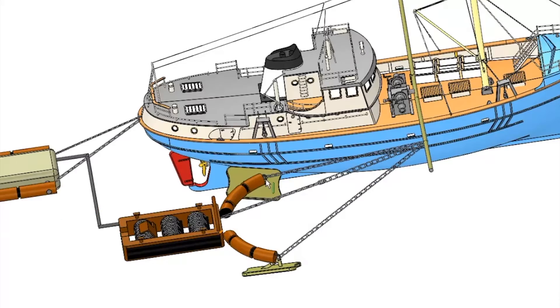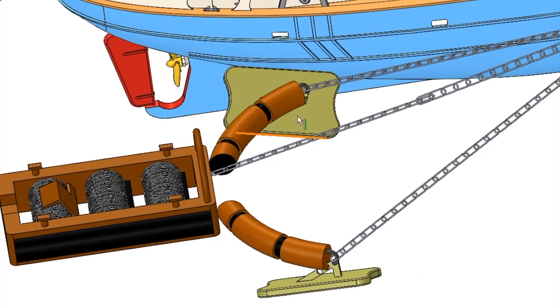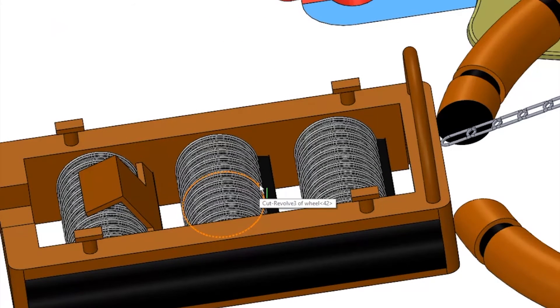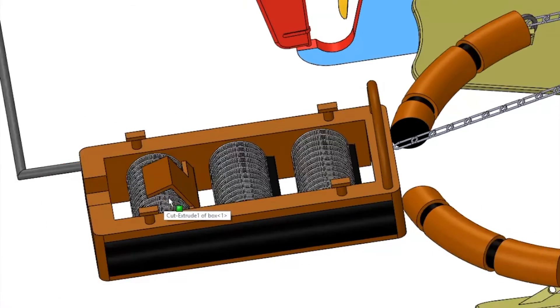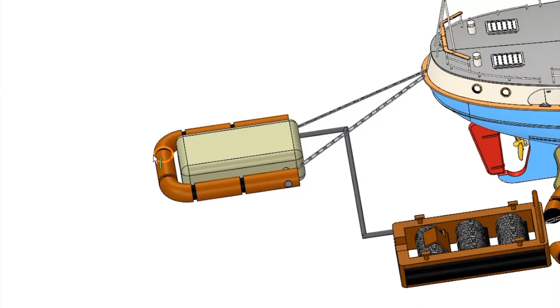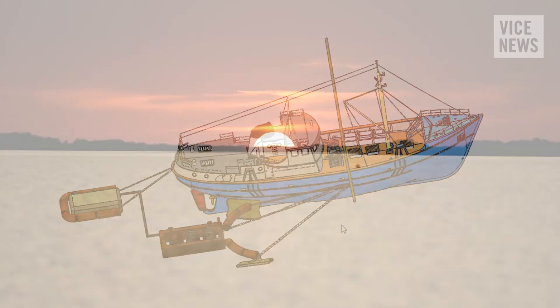Our design consists of three major components. The first are two door-like elements such as the ones used for shrimp fishing, that hold two floater members open to help channel the oil on the water into the oil skimmer. The second is the oil skimmer which, due to its design with rotary discs, can efficiently remove most of the oil from the water. Finally, the oil is stored in an external container which can be easily replaced to help fishermen be ready for action as fast as possible.